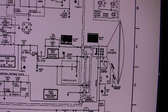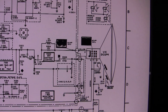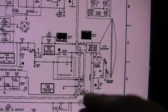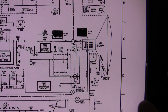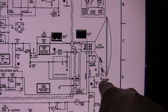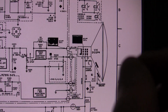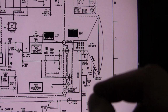Strange. Well, I'm about to post this on the Antique Radio forum because the topic has come up about how we can add a spot killer to this set. By that I mean when you turn it off and it collapses to a very bright point. I'd like to eliminate that. It's common for all the old sets from the 40s and 50s, and there's a certain charm to it. When we get into the late 50s into the 60s, these sets run on a lot more voltage, so it's 16,000 volts. And when that collapses with a strong picture tube, that's a really, really bright point. My concern is that it may eventually damage the phosphor, even though it's aluminized, from that collapse again and again and again with a lot of energy left in the circuit.